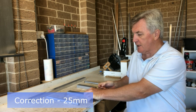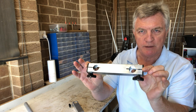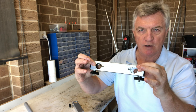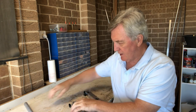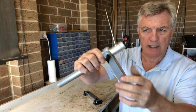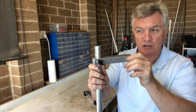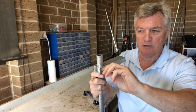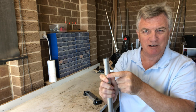First things first — I'm going to drill a 25mm hole through here. Each end will have the usual 25mm holes but we're going to allow a little bit more distance from the edge to the edge of the hole here, and you'll also notice we've got slots cut in it. The reason for that is: if we go back to this one which is what we've been using on the box, when I put that onto the leg and lock down, this actually grips really strongly — just nip it and that'll hold my weight. But we don't need it to hold my weight, and also if you do that it can put a little circular mark on the leg which makes the leg grind up and down a bit.